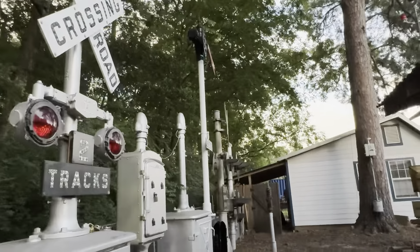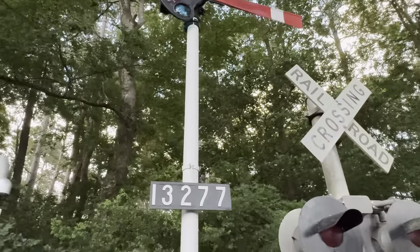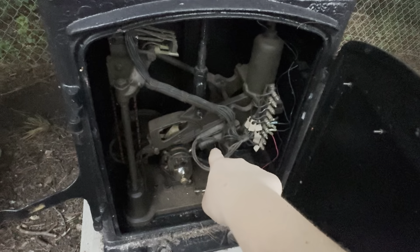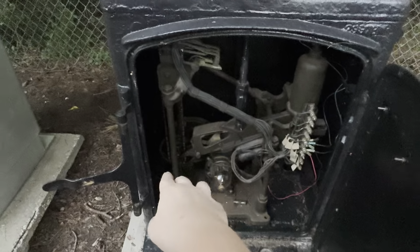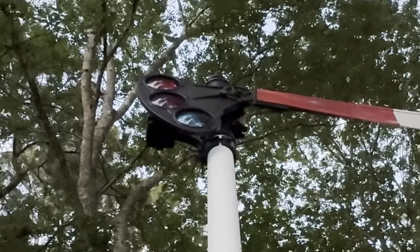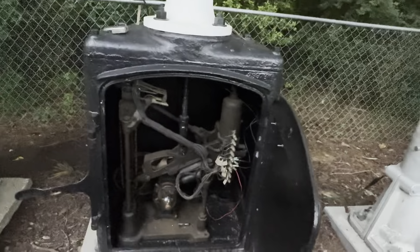You can see the style B has dropped to the stop position and the arm is lowered down. When voltage is applied to the motor it also applies current to the slot coils, which lock the locking dog in place — that allows a hook on the chain to hook it and raise it up, which pushes the spectacle and blade to lower, shining the green lens in front of the lamp instead of the red lens. That's how a style B simplex works, or basically any simplex for that matter.